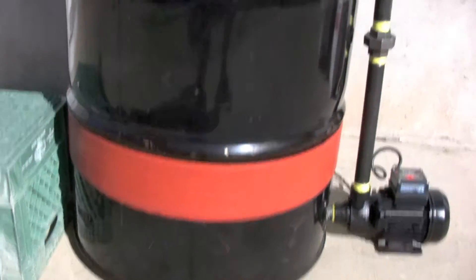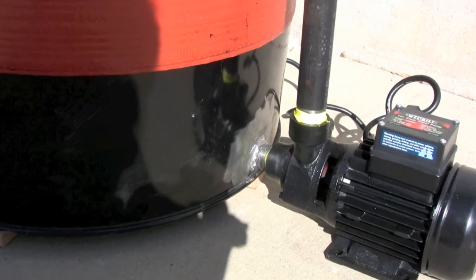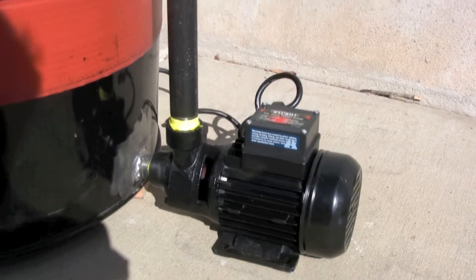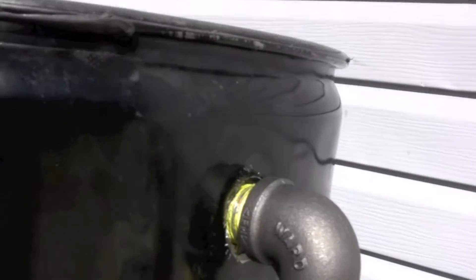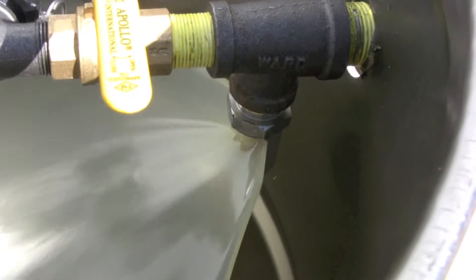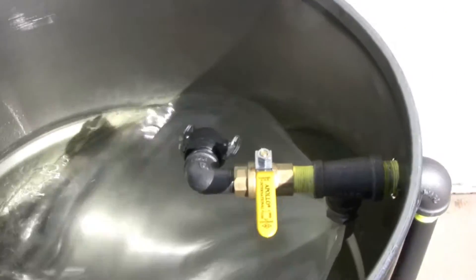The system is fairly straightforward. We took a standard 55 gallon open top drum, knocked a hole in the bottom, welded in a one inch closed fitting, and attached one of our one inch processor pumps. We installed some plumbing with a union, put an elbow on it, and this elbow goes right into the tank through a hole we knocked in it. It connects to a T fitting — our DryPro is hooked to the bottom of it, our ball valve connects to the other side, and then we have a little nozzle so we can direct the flow.